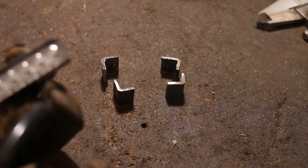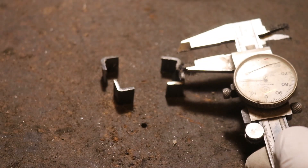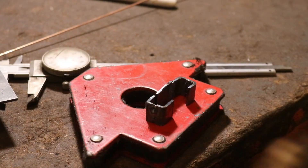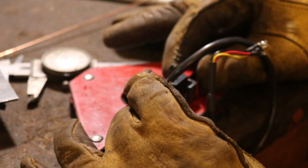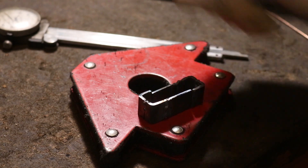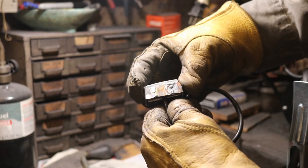Now I've got four of these little guys. My next step is to start putting these little corners together, so I need to figure out how wide this thing is - the answer is exactly four millimeters. So I need to cut these guys and weld them together accordingly. For welding up the corners, first I welded the two ends together, then determined the length needed to make up the middle section, created those two separate little sections, and welded those sections together to create a box - a tiny box that fits a tiny light.